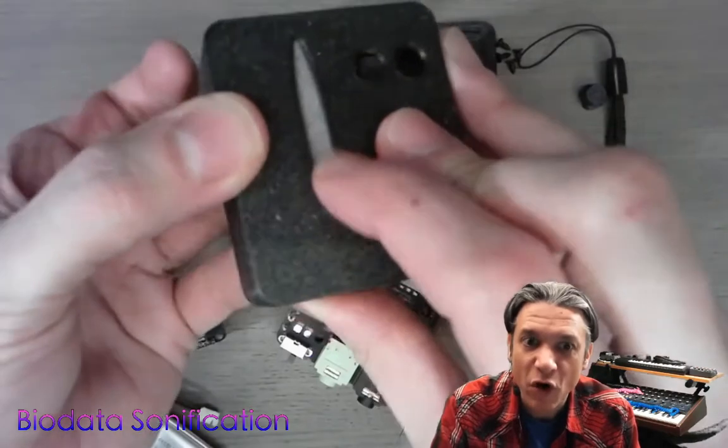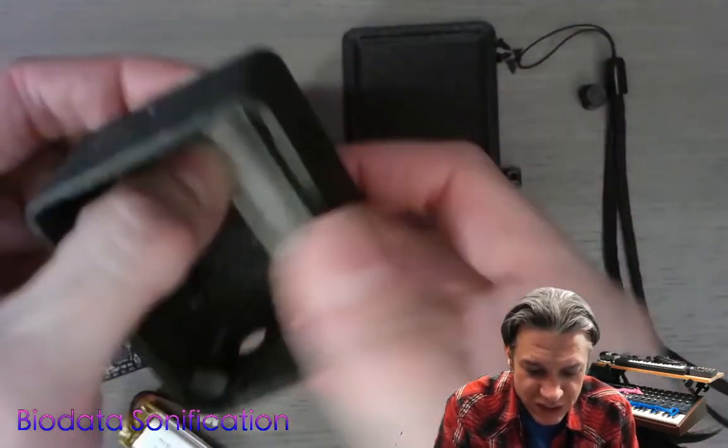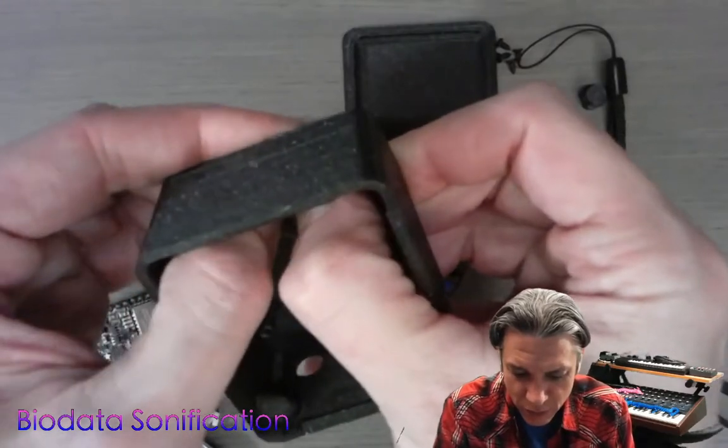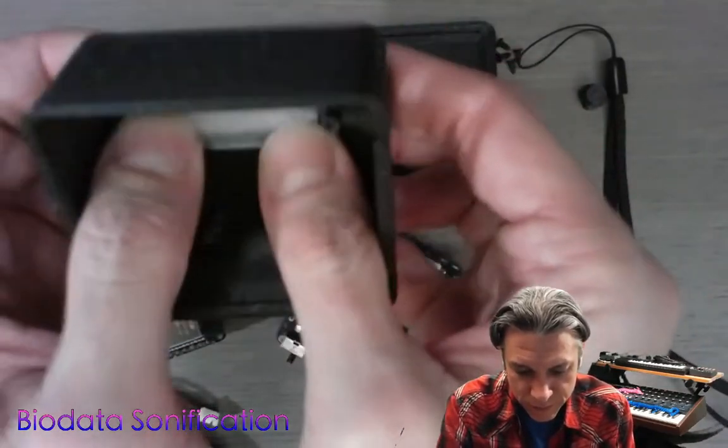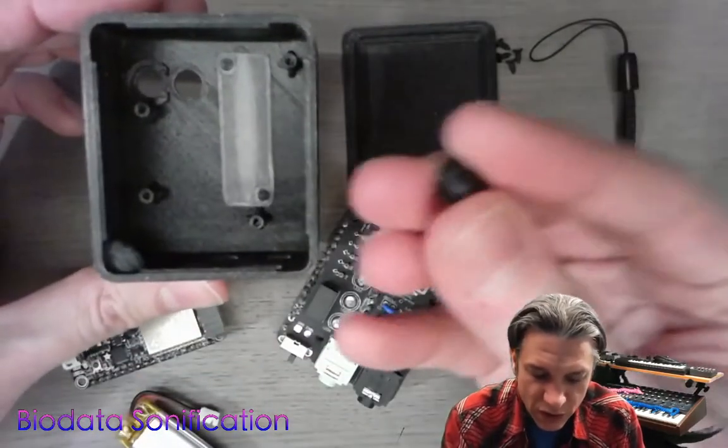You'll notice on this particular design there are two pegs that also correspond to two holes that are in the PETG translucent diffuser. I will just put this into place and everything should click in quite nicely. You can also add a dab of glue in order to hold in the diffuser. It does not come all the way to the surface of the enclosure — it should sit just slightly below.